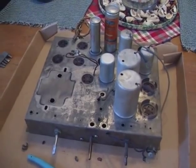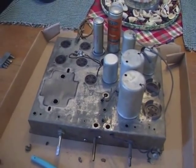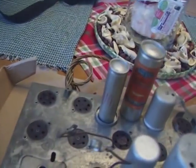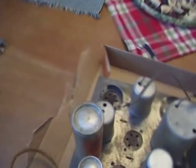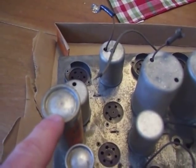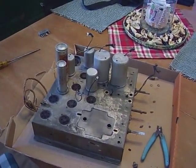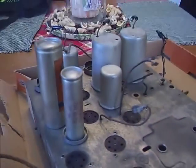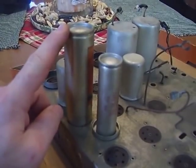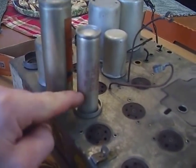I don't know what happened to this thing — there's some soldering work that's been done over the years. One of the capacitor cans is date-coded 3 of 1970, and this one over here has a 1963 date code on it. Anyway, as I was saying before I was rudely cut off by a full memory card: this capacitor can is dated 1970, and this one looks like they cut the base off the original electrolytic and put a smaller can on top — dated the fourth week of 1963. These should be 8 microfarads apiece, and there's another small box capacitor under the chassis.